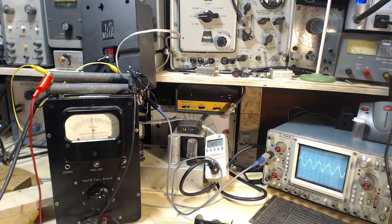Let me just vary that a bit and reduce it. You can see the audio appears to have gone down, which it has. And if I increase it, 75, this is the max that radios are built for. 75 kilohertz swing in the FM signal. But I've had it running right around here. So now we're back on 3 again. Okay, hey, this all looks good.